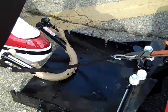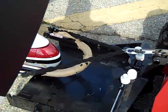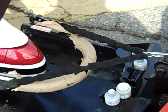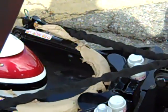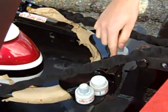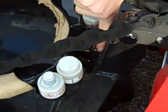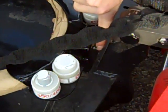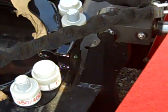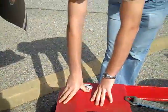Now you just winch the adapter into the receiver. The adapter locks the receiver into place on the adapter post, and you can see that the tip of that pin shows the operator that both are secure on the cradle of the aircraft. Then you raise the cradle and you're ready to move the aircraft.